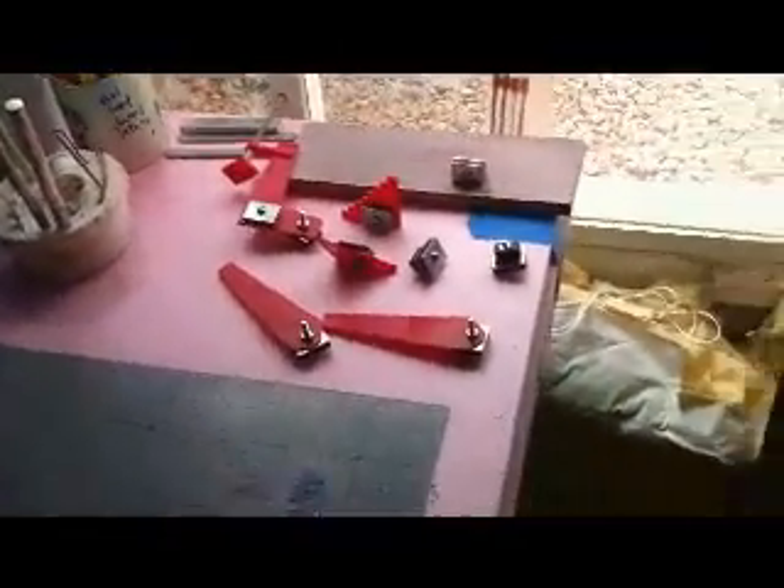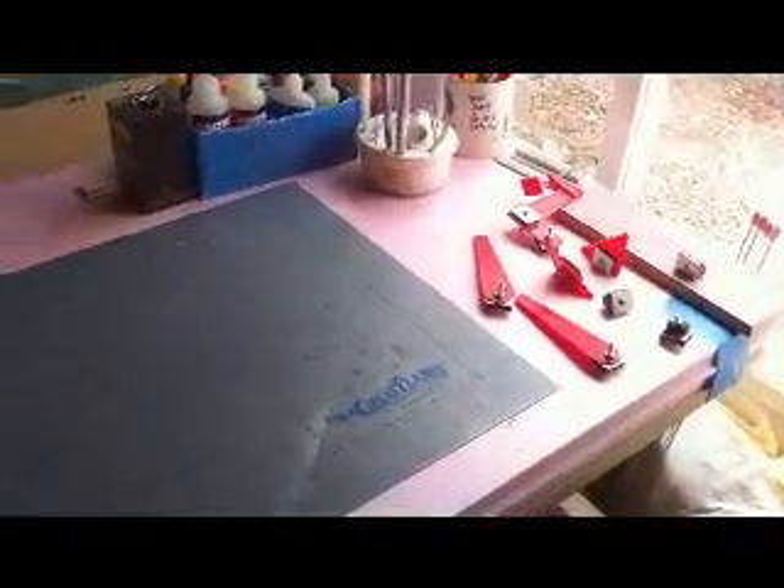Using the magnets, I'm going to show some examples with these over here. Typically with the building system you have a whole array of different types of magnets, vices, and steps to hold the parts. Basically what you're doing is creating a jig or a fixture, each time custom-made for the model that you're building.